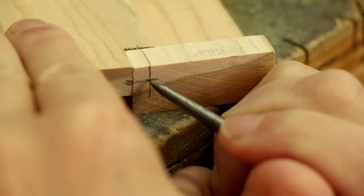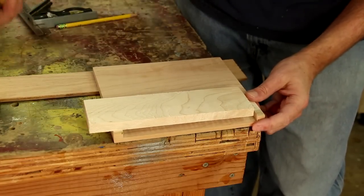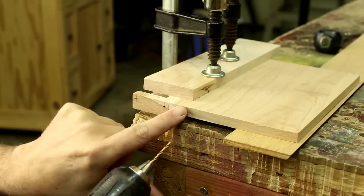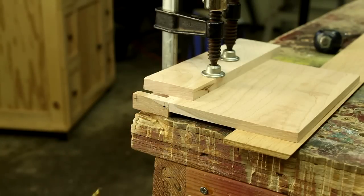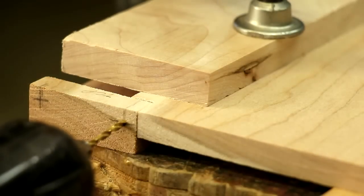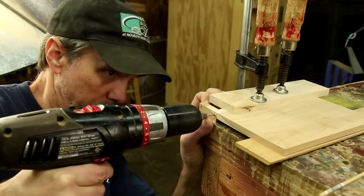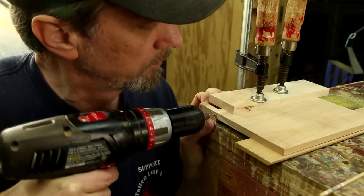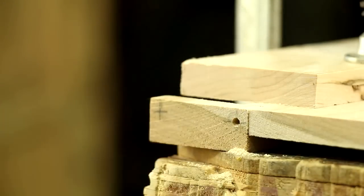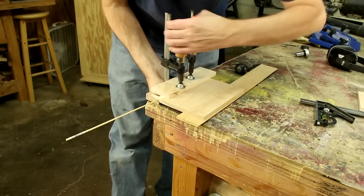Then I'll mark this with an awl. I'll clamp these two together and put a board over this to spread out some of the clamping pressure. I want to drill a hole through this piece and this piece as straight and evenly as possible. I'm starting with a sixteenth-inch drill bit — I want to make sure everything is lined up perfectly. Then I'll use that as a pilot hole and put the eighth-inch hole in. I'm going to hold this together temporarily with an eighth-inch dowel, then just turn it around and do the other side.